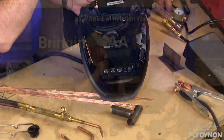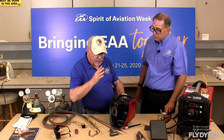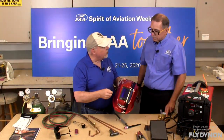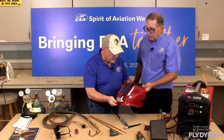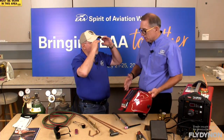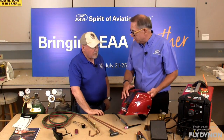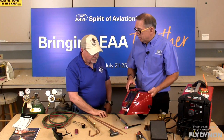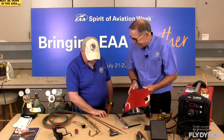It's an amazing, very simple piece of technology. One of the things that's great about modern helmets is the large viewing area — compared to the 1940s one-inch-wide slit, now you have a large area so you can see much more of what's going on. The helmet also protects your whole face against heat, sparks, and ultraviolet rays so you don't get sunburned while welding. And for those of us that can't see very well anymore, you can actually put little magnifying lenses into the helmet so you can use it without your regular glasses — a big deal when you need nice clear vision to see the weld details up close.